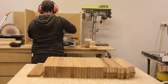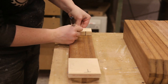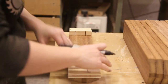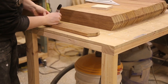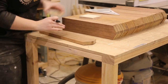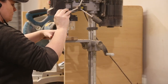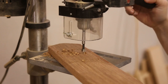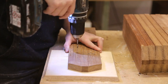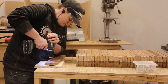I made my way through 36 pickets and then moved on to mark up the boards for the screw holes. I took a little extra time and made two jigs that allowed me to mark all my screws in the same spot on every board. I marked up each board and then used a forstner bit in my drill press to make the countersink holes. I set a depth stop on my drill press so that I was only drilling down a couple of millimetres to have the screw heads just below the surface. I then used a hand drill and a 3mm drill bit to finish the pre-drilling, making sure to put a backer board underneath so I wouldn't get tear-out on the back.